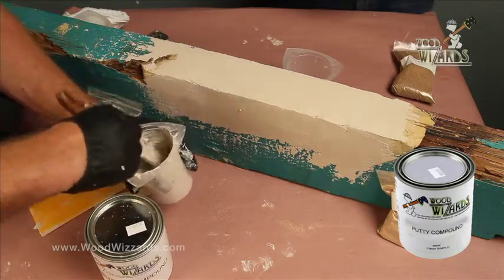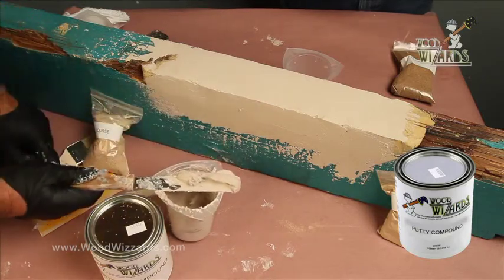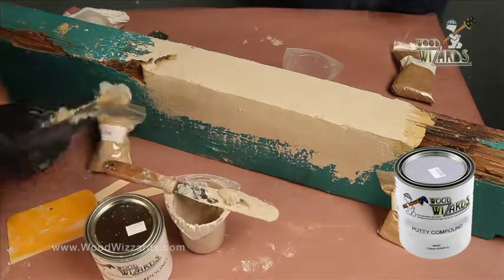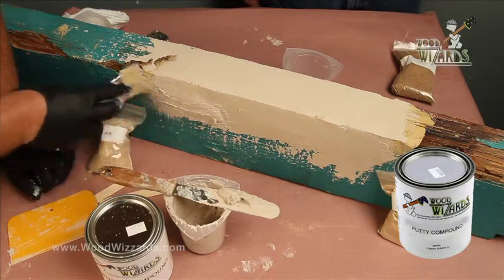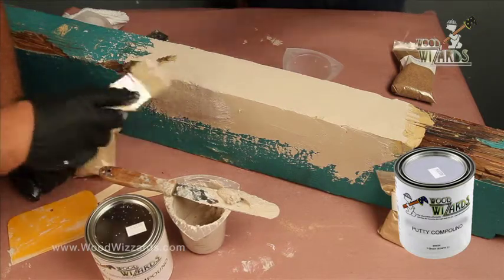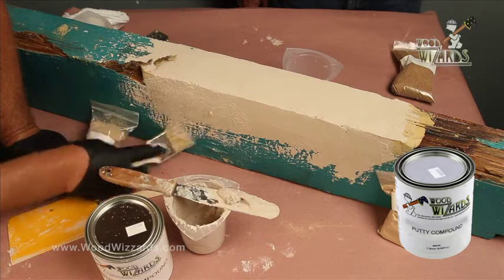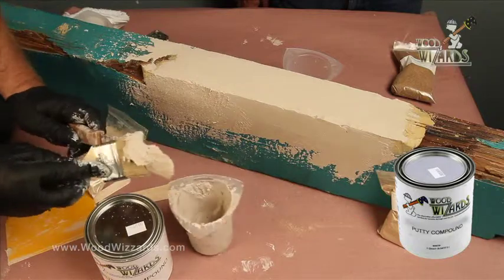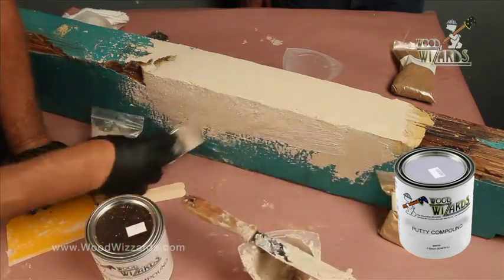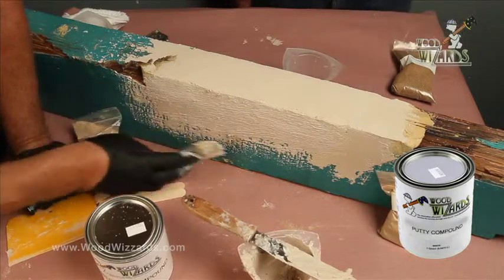We want it to look the same as what you had there, like you didn't even have a finish done. We've got our coarse mixed up. We're going to apply a little bit with a chip brush, or you can put it on with a spreader. Let's try the chip brush first and see what kind of texture you get — be a little bit of an artist here. You're just blending that into the old wood at the repair. I like to go a little bit further so we get it kind of close. This will stick to existing paint exactly. And if you have little cracks in your existing paint, you can go over it with the putty and the thickener. It's almost like you didn't repair it at all — that's what we want. So when this is primed and painted, it'll look brand new again.